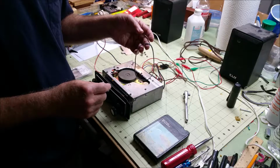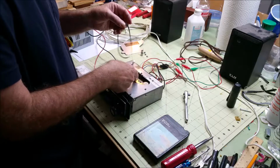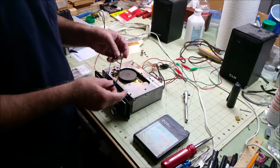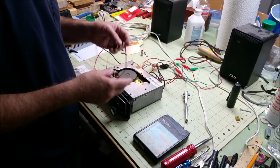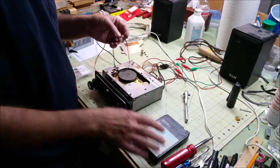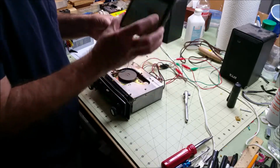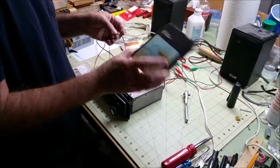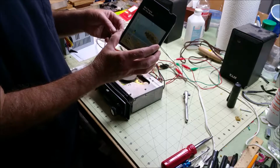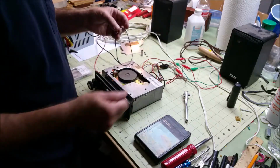I don't know if it really helps or not, but it doesn't hurt. So I flipped that over, I cleaned the motor pulley, I cleaned the capstan flywheel, and it actually plays. It plays pretty well. For the wow and flutter, I don't hear any wow. I do hear a little bit of flutter, but it could be the tape. This is just an old tape that who knows what condition it's in from original. Plus it's Neil Young, and it's kind of hard to get a straight singing tone from Neil Young, so it's hard to know really what's flutter and what's Neil Young.